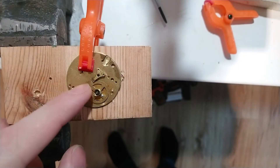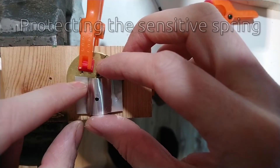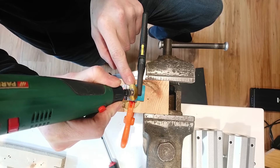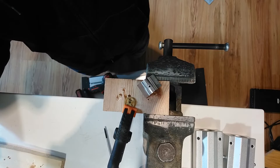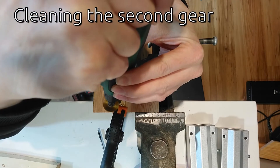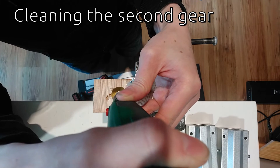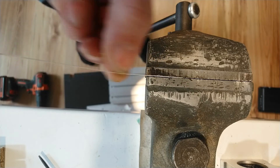The other indicator had some damage on the inside that wasn't visible at first. The gear axles had gone rusty and the gears were stuck in their bearings. I had to carefully clamp down each gear and wire brush the rust off the axles. The bearings got polished by pulling a string through them.